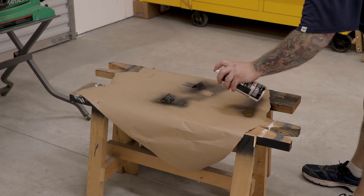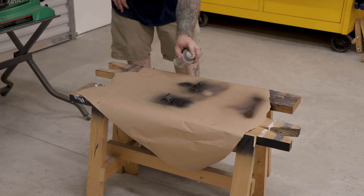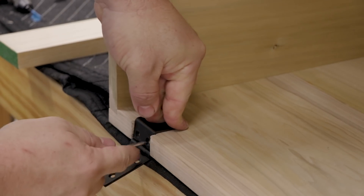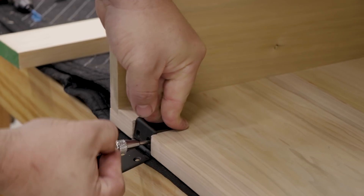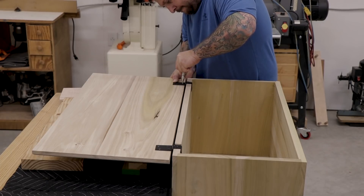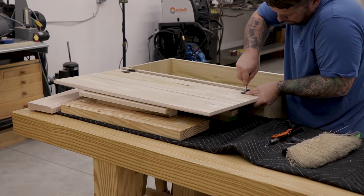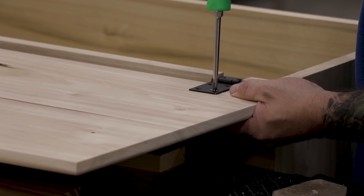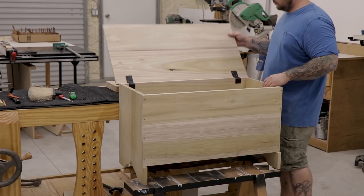The last step is to paint the hinges. They come unfinished and I thought black would be a fine color, so I took some spray paint and threw a couple of coats on and let it sit overnight. The next morning I test fitted the hinges into the case and used a punch to mark out the screw locations. I screwed the hinges into the lid so they'd be secure enough to start working on the top. To align the hinges on the lid, I set the case up next to the workbench, propped the lid up on a couple of scrap blocks, moved the lid into place, and marked out where to put the screw holes for the hinges. I installed a couple of screws to test fit the lid and make sure everything was opening and closing properly.